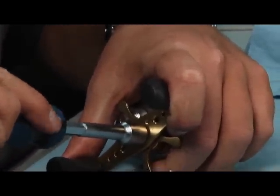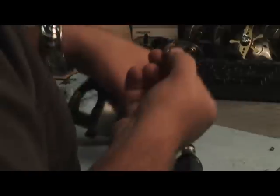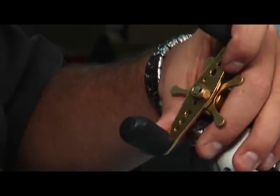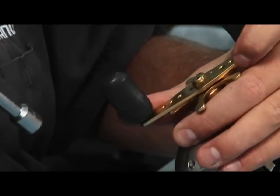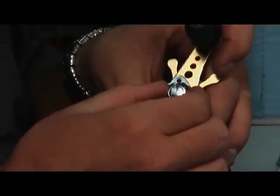Hand tighten just until it stops. Now when you're putting the handle cap on, it's notched to fit the nut, so you need to get the hole on the cap to match up with the hole on the handle. Look at the cap — you need a point of the nut directly pointing at the hole, or a flat spot of the nut directly underneath the hole. Cinch it down and see where it's at; you may need to go a little looser or tighter to get that flat spot perfectly underneath. Once you have it lined up, put your handle cap on and those two holes should match right up, then install the screw.